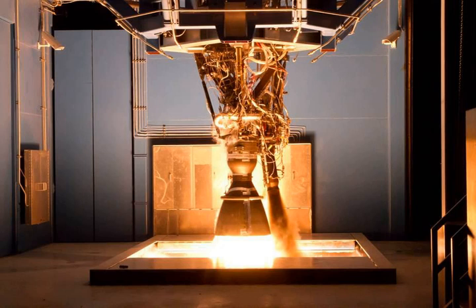On March 10, 2009, a SpaceX press release announced successful testing of the MERLIN-1C vacuum engine. A variant of the 1C engine, the MERLIN-1C vacuum features a larger exhaust section and a significantly larger expansion nozzle to maximize efficiency in the vacuum of space. Its combustion chamber is regeneratively cooled, while the 2.7 m long niobium alloy expansion nozzle is radiatively cooled. The engine delivers a vacuum thrust of 411 kN and a vacuum-specific impulse of 342 seconds. The first production MERLIN vacuum engine underwent a full-duration orbital insertion firing of the integrated Falcon 9 second stage on January 2, 2010, and was flown on the inaugural Falcon 9 flight on June 4, 2010.